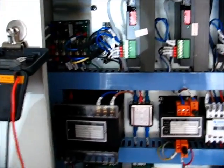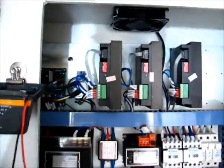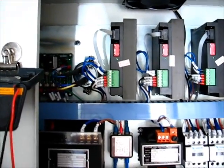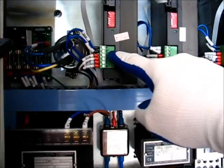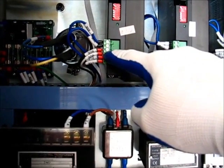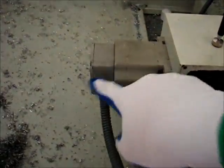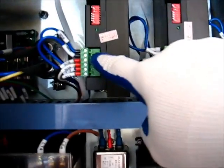One of the things I've done for diagnosis is checking the winding resistance on the motor. These four wires right here — 308, 309, 310, and 311 — go to the stepper motor on the X-axis. Tormach has instructions in the manual as far as the expected resistance between each of the wires.